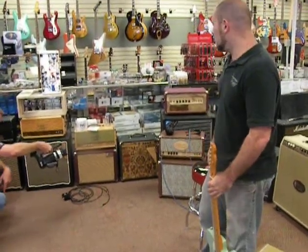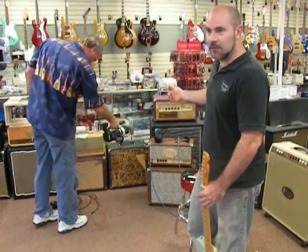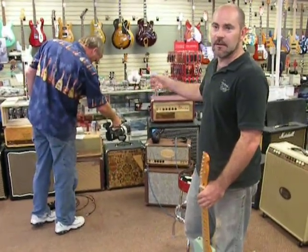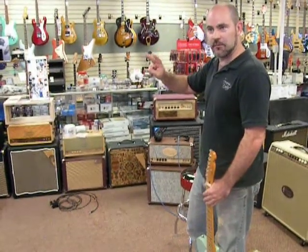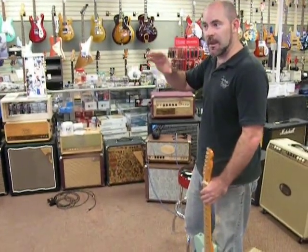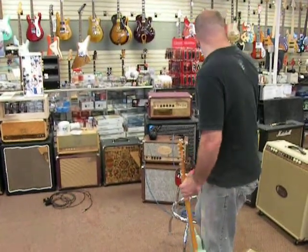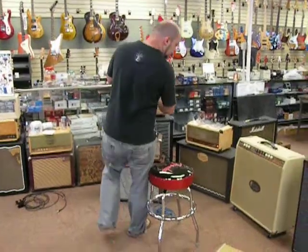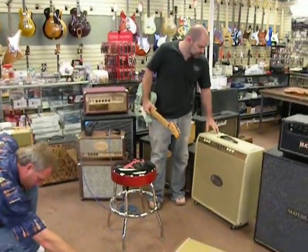That's our bass amp. It's a true hybrid, so it's got a 6SL7 as the preamp section and an EL84 driver tube, but it's a solid state power section. But there's 2 power sections, so it's really a tube amp. We're just driving it with MOSFET. And then we've got this right here, a Classic Series Super Reverb that we did for Dan Harden also.